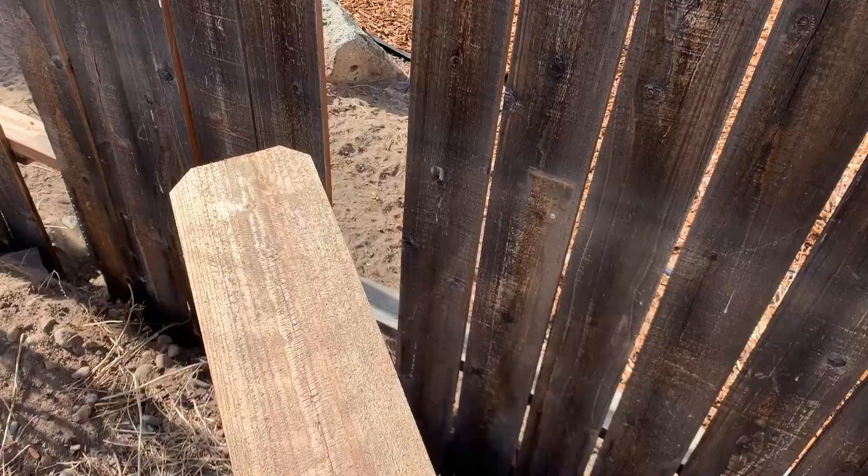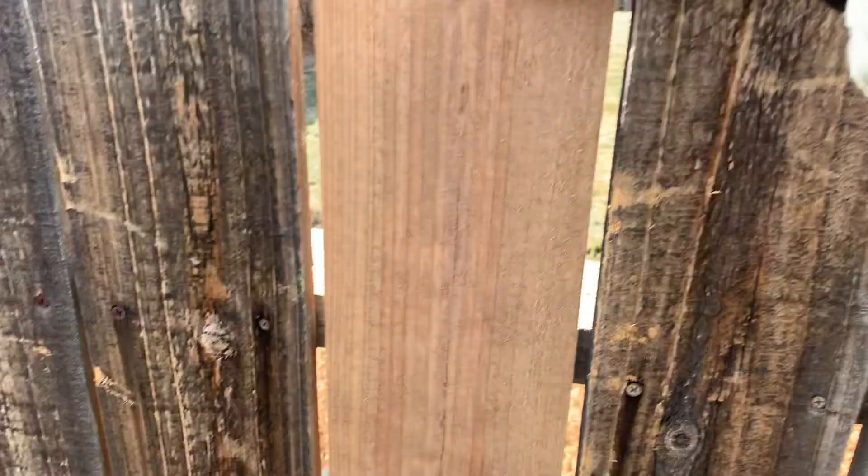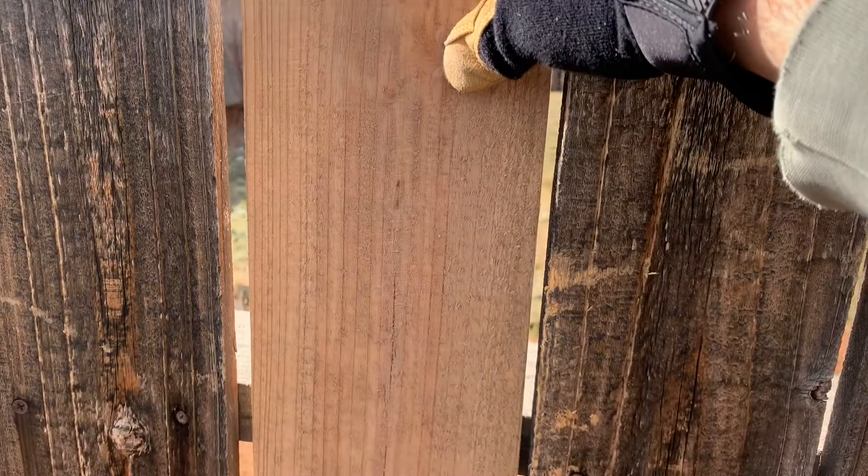Let's get our new picket into place. I'm just going to stick it down kind of where the old one was and we can center it up. As you can see, it's a little bit low if it's resting on the ground, so we're just going to lift that up just a touch until we match the top here. That's where we know we need to drill in. You're going to place your screws right here so that it goes into that supporting 2x4 that's in the back. Same thing on the bottom — you can make sure things are lined up nice and straight.